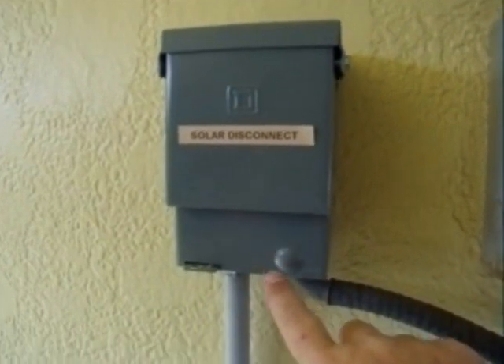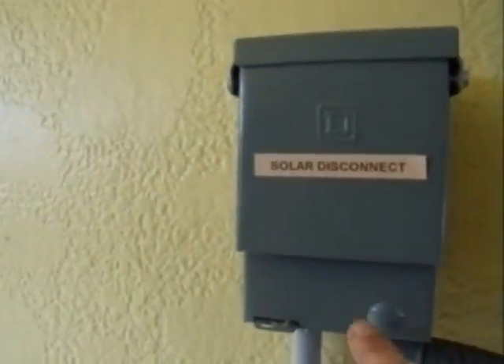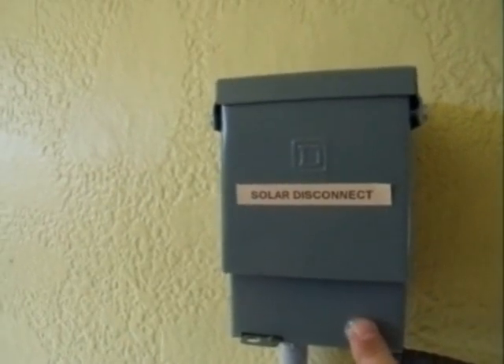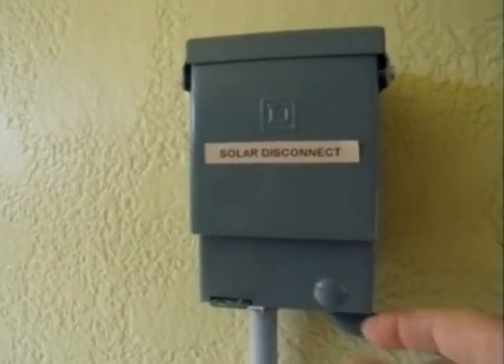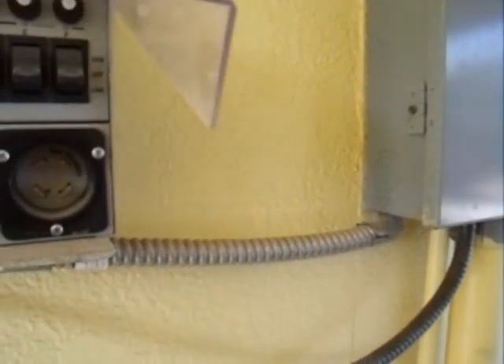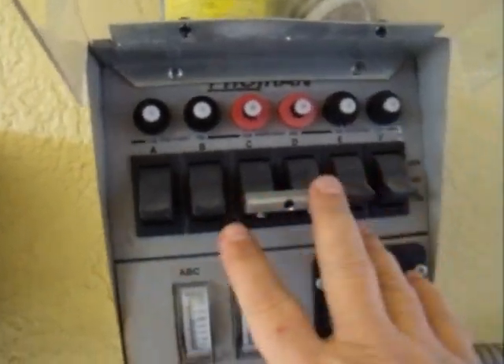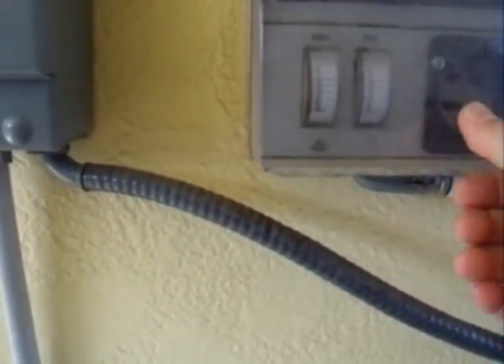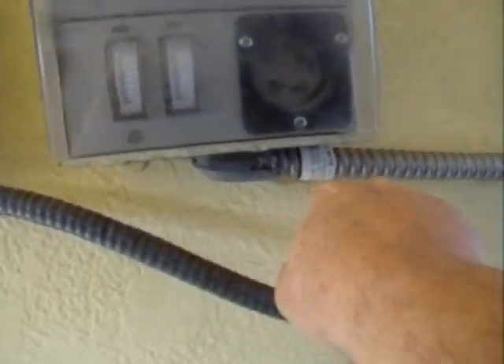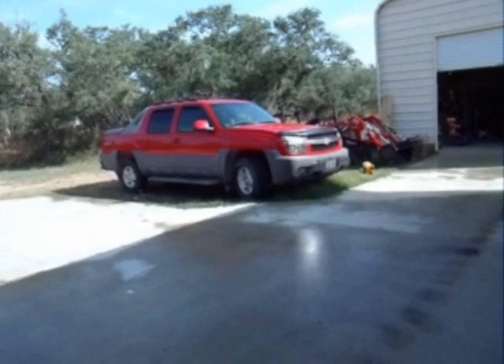This is my other grid-tie system from my Sharp panels — I have another 2 kilowatts of solar power there. This is the power that uses microinverters, and those are already permanently wired here — so there's a couple of kilowatts going in there. This is the power that's going to be brought in. I'm going to have a female plug that will just plug in here and be ready to go. I'll have everything ready with the plug just unplugged, and whenever I need to switch to my standby power, it will be a fairly easy affair.